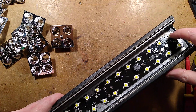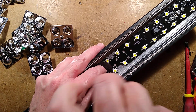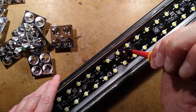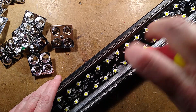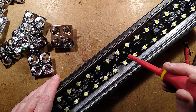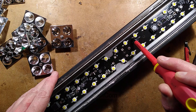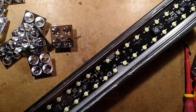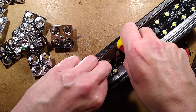Let me show you it lit — the bench power supply is on here. There are signs of corrosion; oddly these pads are super clean, but where the LEDs are soldered on there is corrosion — maybe that's just the flux. The inside is extraordinarily clean and dry, which is surprising given that this isn't exactly a new fixture. It's been out on a boat bobbing about in the Irish Sea for quite some time.